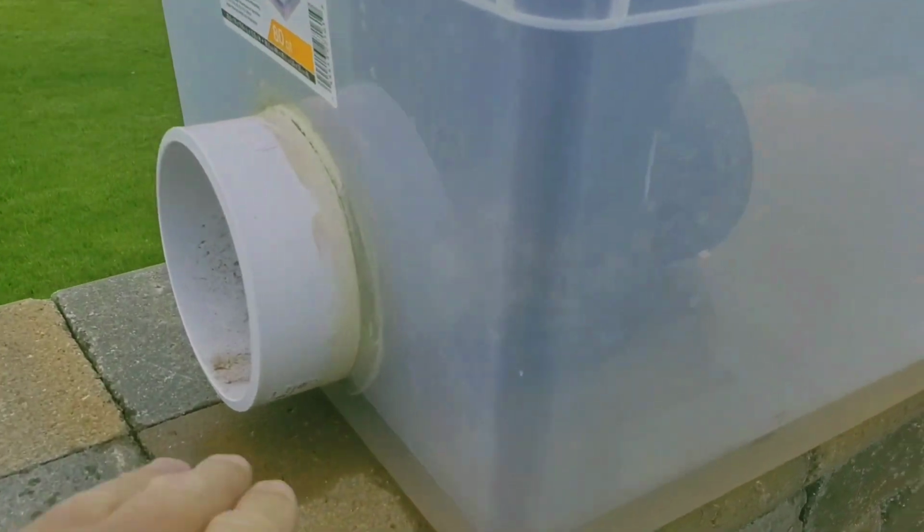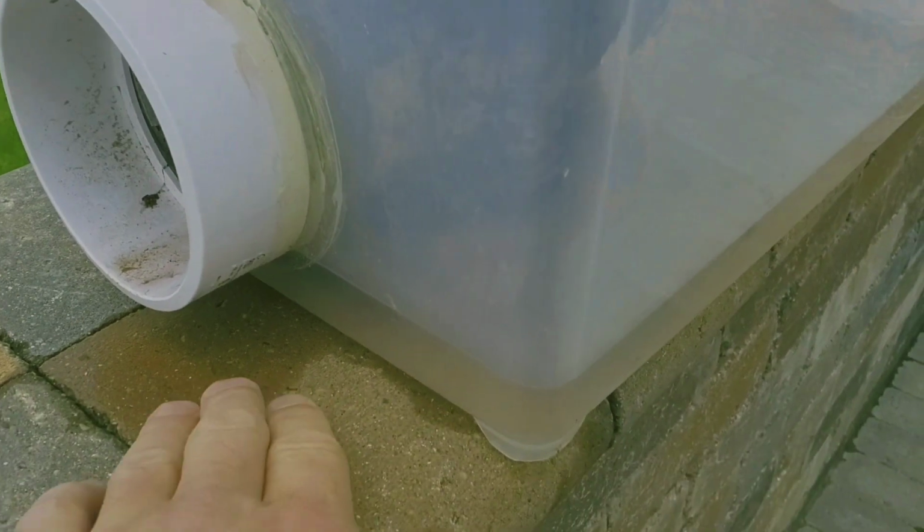Check this out. So set this one out here. You can see when the water hit a certain level, it ran out of this. But as I keep preaching, do not use inline basins with your French drain. An inline basin is only meant for a yard drain. So go to my video, how to build a yard drain in a French drain, if you want to use inlet basins so that you don't contaminate and jeopardize all that hard work.